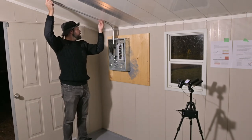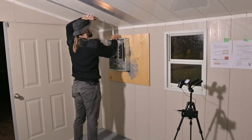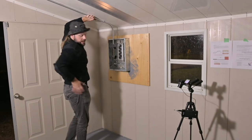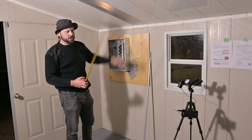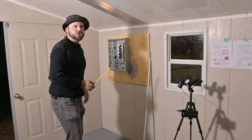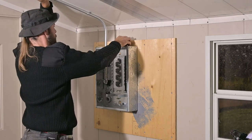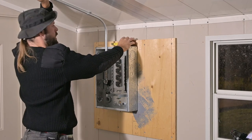If I want it here, pasted into here, and that seam there, that's going to miss my conduit hole. So what are the chances we can bend it this way? I know we can — it's just a question of do I have the skill to do it. I'm going to have to go get a better measuring tape though, because this Milwaukee — your auto lock does not auto lock anymore, and it's killing my groove. This little Mastercraft should do. We want the conduit here like that. We need to make it move over one and a quarter inches.